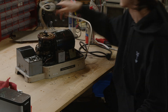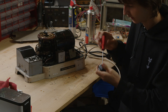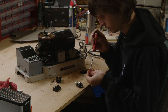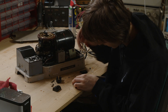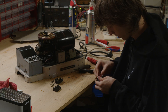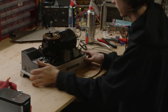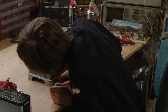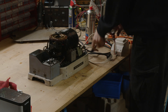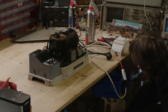What I now want to try is getting a new power plug on here, because that's an old style and we don't have those kinds of plugs anymore. I mount the new Swiss power plug onto it, and now I would like to see if I can get it running. Here I have my isolation transformer — plug it in, and then I'll plug it into my 500 milliamp fuse.